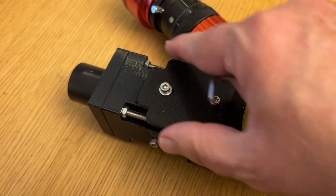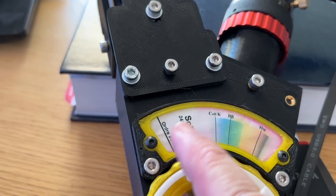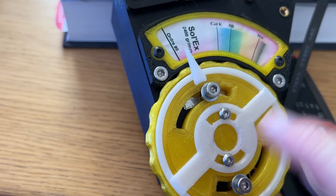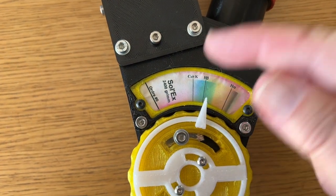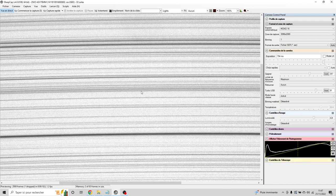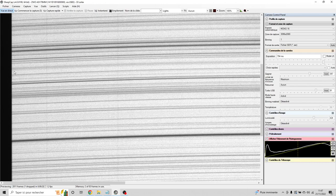Take advantage of having the image in order zero in the center of the sensor to adjust the index on the wheel of the grating, positioning it in front of the mark order 0 on the printed pattern. Unscrew the 2 M3 screws and turn the index to bring it in front of the 0 mark. It is now easy to move in the spectrum with knowledge — for example, going to the green part to see what happens there. Note that the spectral lines are very thin, which is a sign of a good setting. Look at the image of one of the edges of the slit — this boundary is also very sharp, which is a confirmation of a good setting.